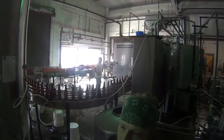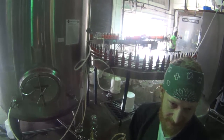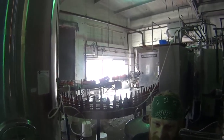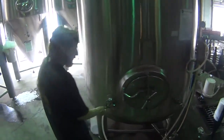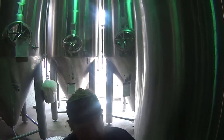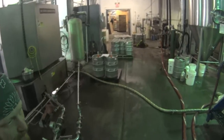What's the difference between lager and ale? Just the yeast. Lager yeasts are usually cold-fermented. They don't produce a lot of fruity flavors — they're known for producing a little bit of sulfur, like a pleasant amount, not like you just put a match out. The beer isn't carbonated yet when it goes into the bright tank. There's a ceramic stone in here and we pump CO2 through the stone, so it creates billions of bubbles coming out into the solution. The CO2 dissolves into the solution — it usually takes a day or two.